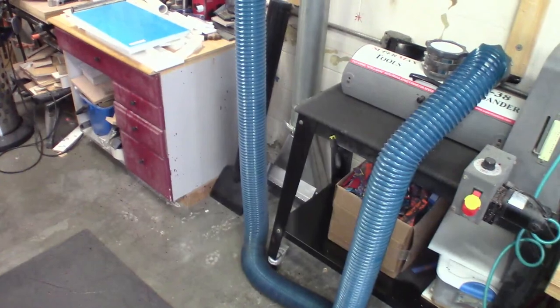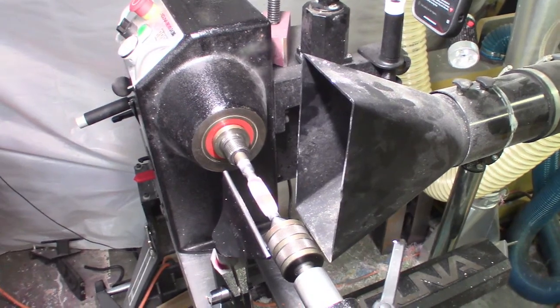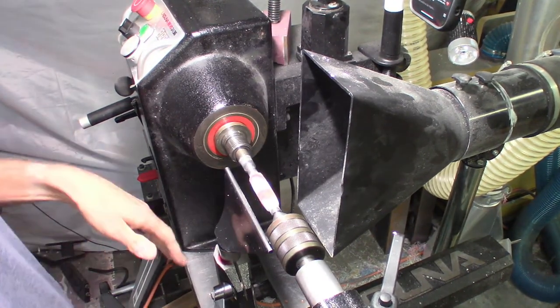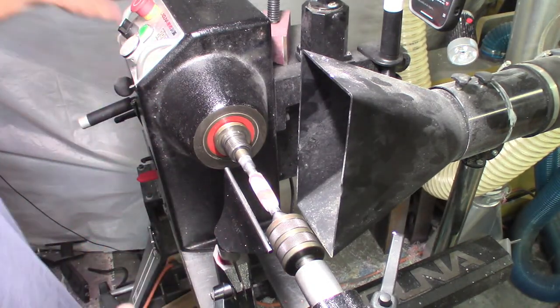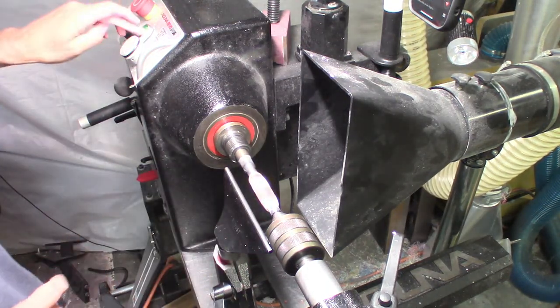And so I've got another floor sweep, maybe you can't really see it, but it's back down in that corner. And that was a recommendation that was given to me by Oneida, actually, when I was setting up my system. They were like, if you're gonna put a full duct system in, we recommend that you get these floor sweeps for two reasons, actually. One is that, like I said, pulling the dust down to the floor. But the other thing is, it also anchors the ends of the legs, so that you can anchor it to your floor, which, I gotta be honest, I never actually did bolt down, but it's more sturdy, and it also moves the air in that direction.